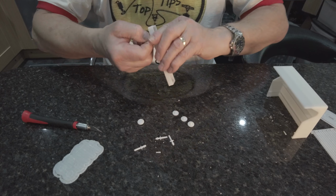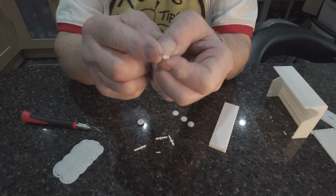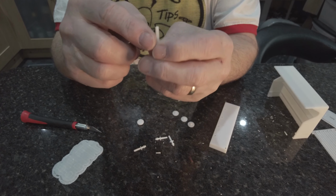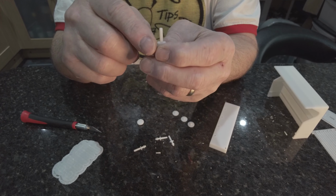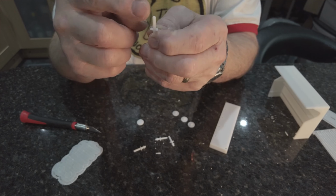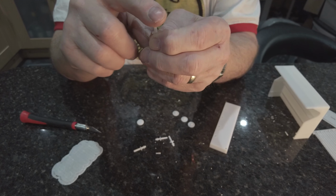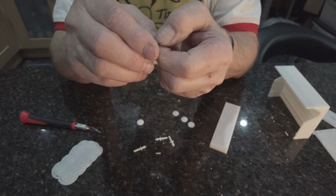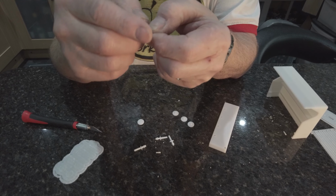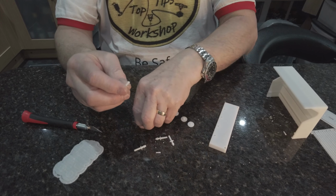and they do. Okay, even though if you look at that, what I've done is, because to actually print that, if you printed it stood up like that, you very rarely get them correctly. A lot of printers wouldn't be able to print that fine quite easily, it'd be all over the place. So I print mine laid down, and I print it as a square with 4 corners just slightly taken off, and it's absolutely brilliant.